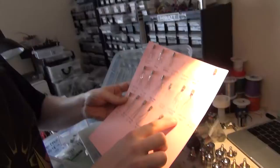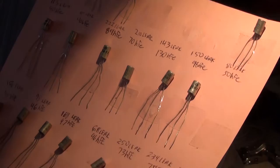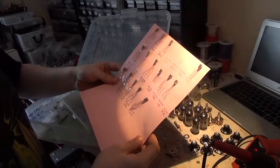These often require careful measuring. You can see here there's leakage versus HFE — he went through and did all these measurements to identify exactly what each one is. Certain circuits, like a Fuzz Face for instance, will specify the first transistor should have a certain amount of leakage and the second transistor a certain amount. Different circuits call for different things.